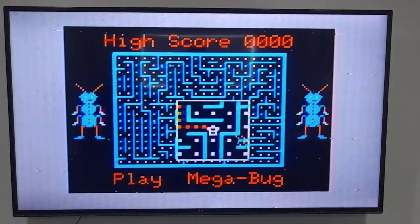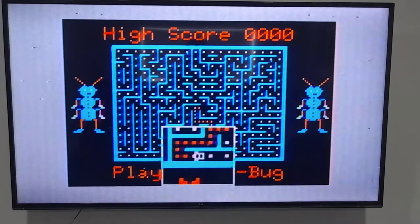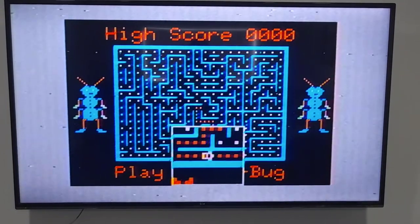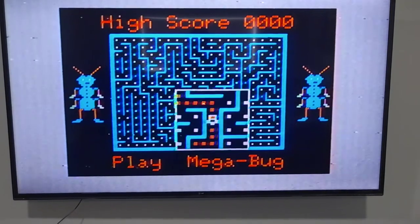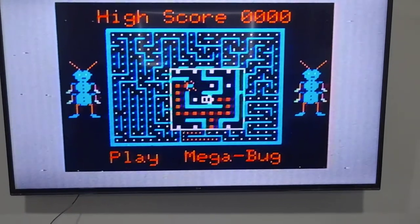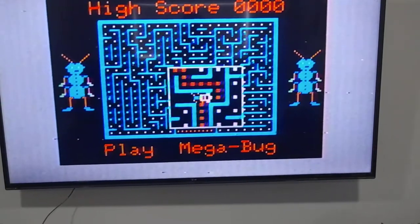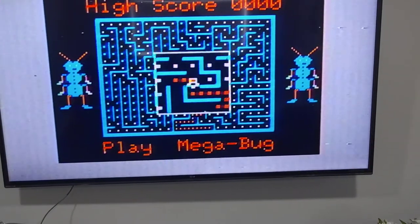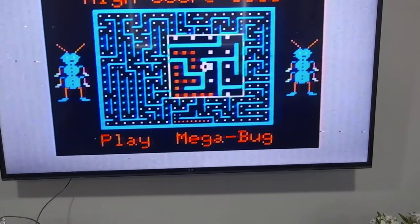I mean, for RF, that's pretty good. I just need to make those two changes. Shorten the board by, literally, 1 millimeter, right? And then move one of the mounting holes half a millimeter, which I think I already did actually. And I will call this done. This will be a finished board.